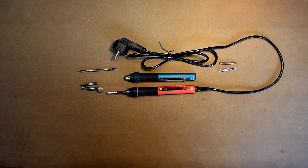I would like also to mention the disadvantages of the mains version. The device is really very good, but if you would like to make it portable and use it together with a power inverter, you should know that the device works only together with a pure sine wave inverter. So no UPS except smart versions and no common inverters with a modified sine wave. In that case, the screen displays some digits within 2 or 3 seconds and then turns off. I turned it off then on approximately 4 times and then the electrolytic capacitor simply blew up.